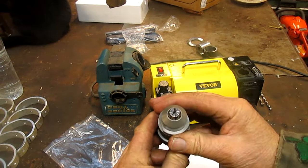A little bit too much of a cut there, but it brought it right back in. The web is just a little bit too wide. Now it could be that the bit is starting to get, well, I don't know, it looks pretty long. There goes that breaker again.